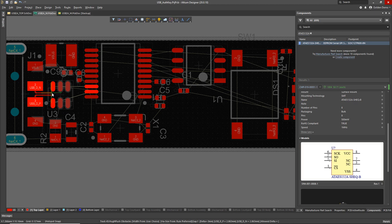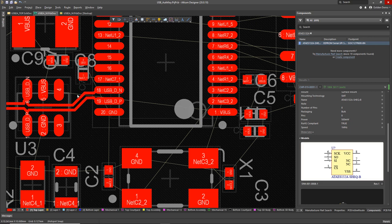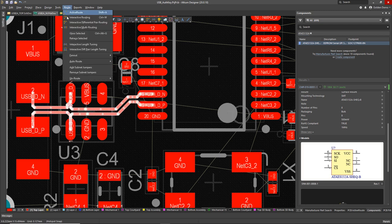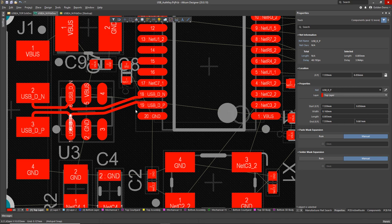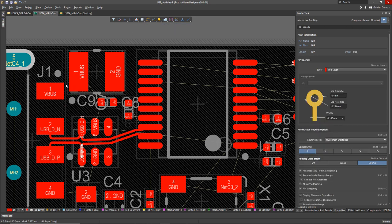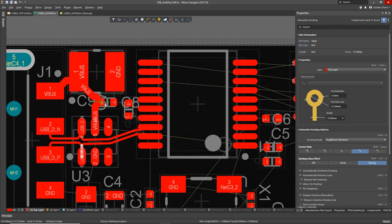I've defined a 90 ohm differential pair and 50 ohm single-ended, which I can reference in design rules. Let's go ahead and start by routing the USB differential pair. There are all sorts of different options, and you can see it's going to hug around other things. If I want to make that more curvy, I can select it, hit Tab to select the whole connection, and use the glossing feature. The glossing makes really beautiful routing. If I want to change the width of the power supply, I can hit Tab and adjust that in the properties panel to the right while I'm routing.